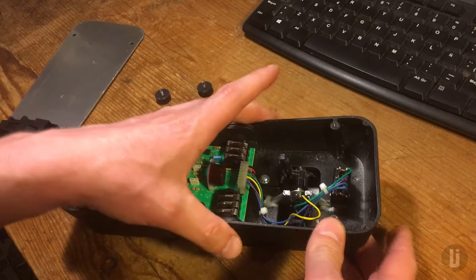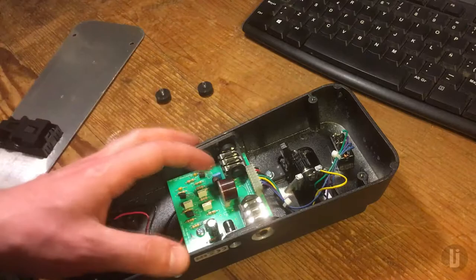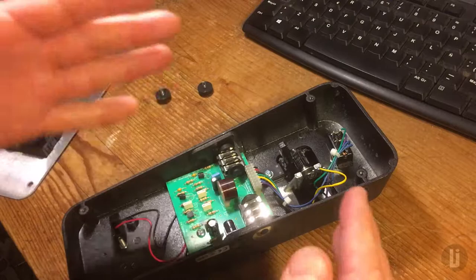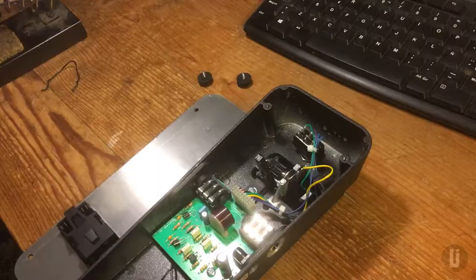Number one, I'm going to move this thing a couple teeth back so that the pot gets some extra range — hopefully squeeze some more range from the pot instead of having to switch the capacitor and move the switch by remounting the circuit. I don't want to do that. And we're gonna have to modify this resistor to increase the Q factor — this one goes in parallel with the coil. Google 'vocal mod' — it makes the peak of the resonant frequency go higher. I might move it from 33k to 68k, and also I'm gonna wire this as a true bypass.